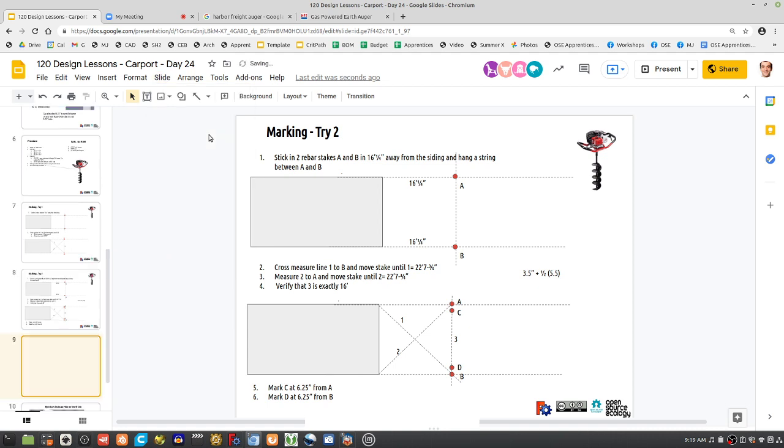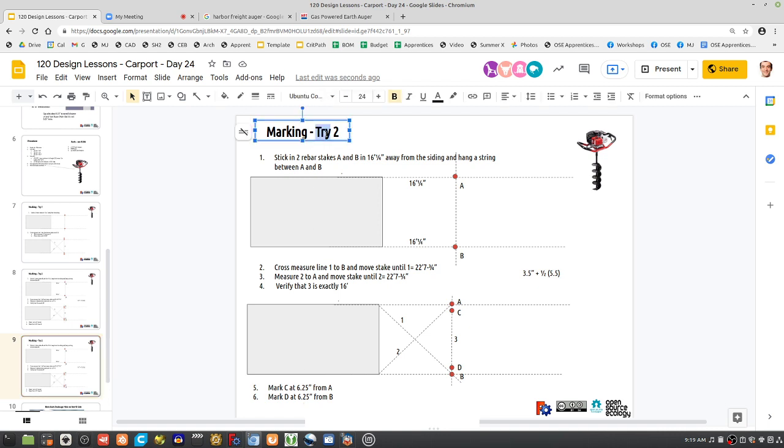Let's actually put that on a separate page, because you have to account for how the auger digs, and you can put two holes that are very close to each other, but not exactly touching, just from experience. So for augering, I would say do two holes next to each other, so that the six inch post will definitely fit in there, but not too huge. So I think two of them would be pretty good. Two of them side by side.